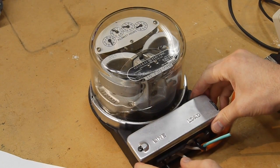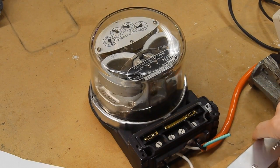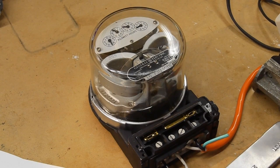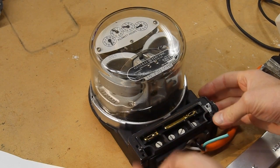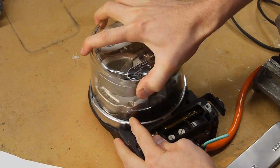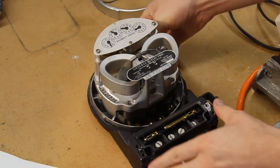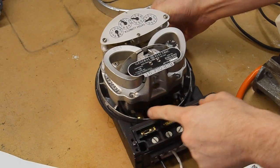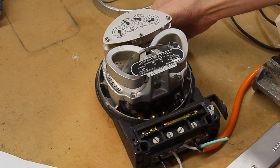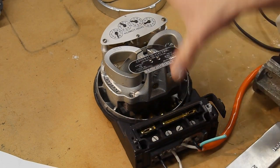The cover is marked line and load, and if we take this off we can see that there are four terminals here, set up so that the neutrals are in the middle and the hots are on the outside. This is a commercial power meter, so it actually has a little latch here, and if you move the latch out, we can unscrew this glass top and have that come off. You can see that there are actually six connections inside there, which are connected in such a way that only four come out.